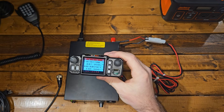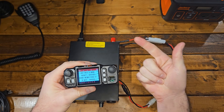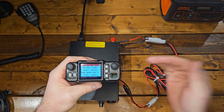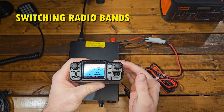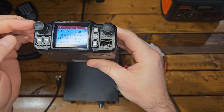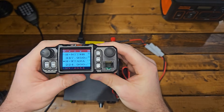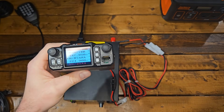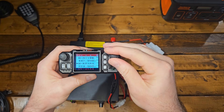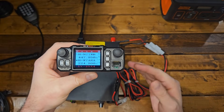One thing I want to show about this radio is that it is tri-band — that means it covers the 70 centimeter, the 1.25 meter, and 2 meter bands. Whenever you're on the 2 meter or 70 centimeter, it utilizes a single radio inside. When you switch to the 1.25 meter band, you're going to hear that thing click — it has to activate another system in there. It is nothing wrong with the radio. When you switch back to 2 meter and 70 centimeter, that clicking will go away.